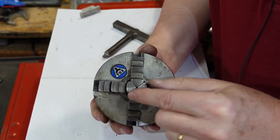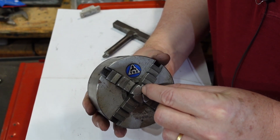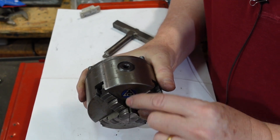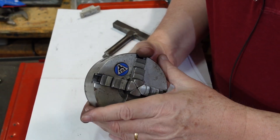You may recall I just said that these things work if the jaws are properly aligned and come in at just the right size. This is not too awful but there is a little bit of wear - that gap is a bit higher at the top than at the bottom, and you can actually see some daylight through there, so worn jaws are not going to help.